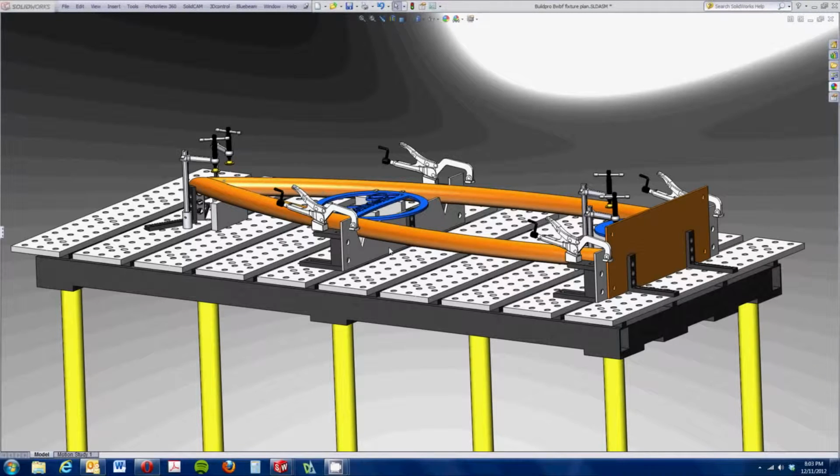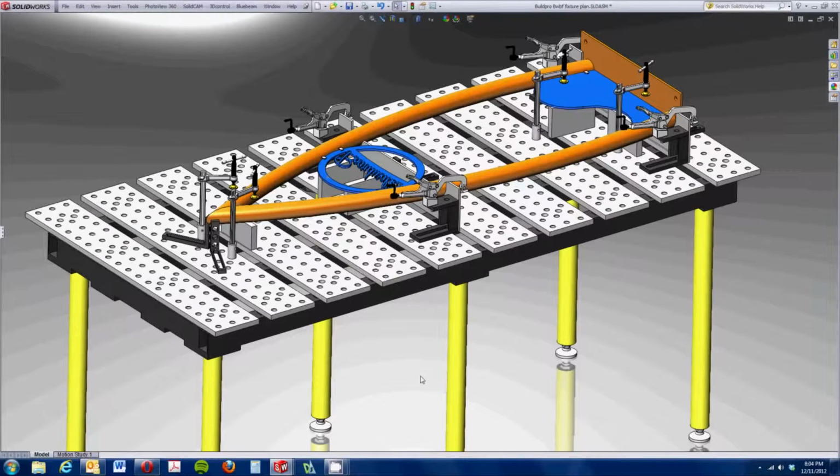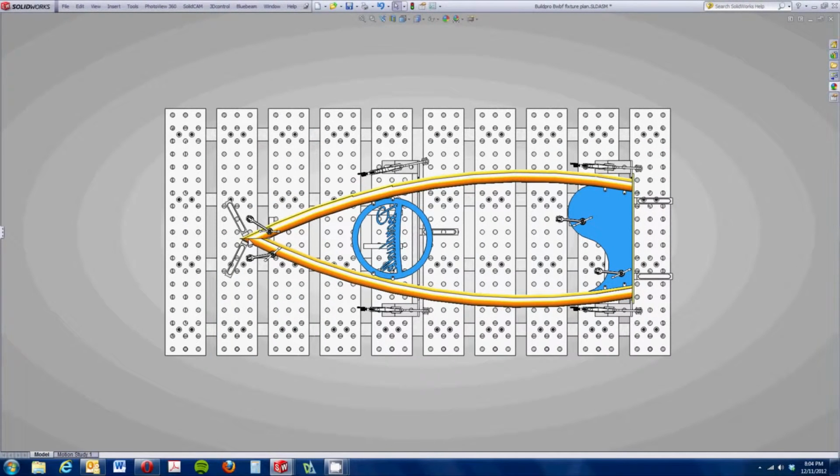I laid our assembly down on the table and started using some of the clamps and right angle brackets to design our fixture. While I was having the blue components laser cut, I also cut that gray V-block plate so that we could accurately index our steel tubing, and also the blue components at a correct height. The blue components would stay clamped down during the production run, and then we'd put the orange components in, tack them all together, pop it out of the fixture, and move on. It turned out to be a really efficient process.